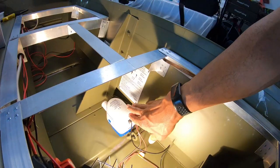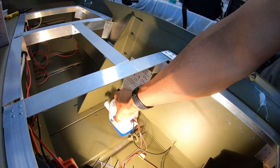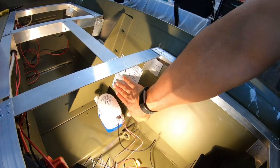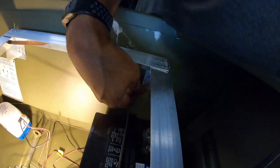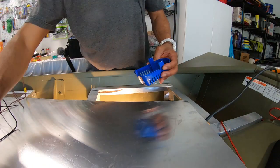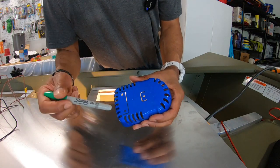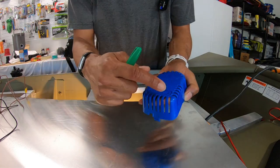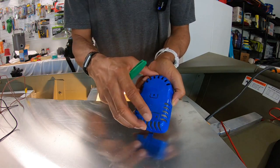I might need this spot, so I'll install it right here. What I'm going to try to do is fabricate something using aluminum sheeting to get the bilge pump securely put down here — probably attach the base of this to a sheet of aluminum, bend it, and secure it to the rear of the hull. I removed the bottom of the pump. We've got three holes right here and this is where I will rivet into the aluminum. I'll trace out the aluminum and go from there.